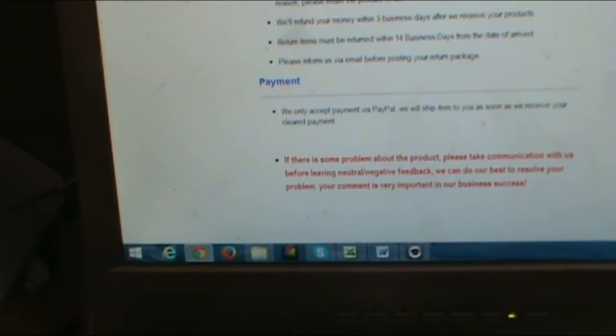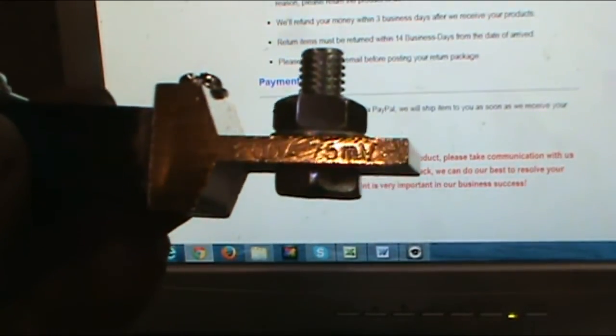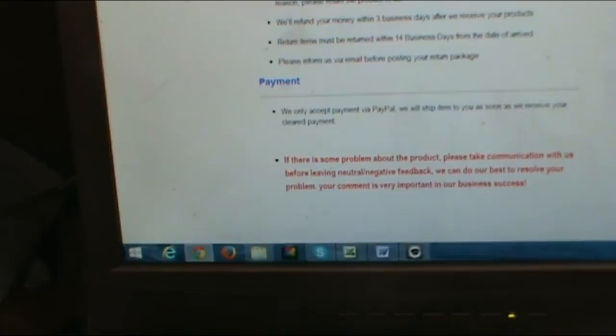There are two little shunts in here. These are nickel-plated brass — you can see it's got 'BR' on the side for brass. The shunts are the exact same as the ones I've already got — 200 amp, 75 millivolt — and I've got two of those. I'll put those up in my totes when I'm ready to use them so they don't get lost, up with my other shunts.